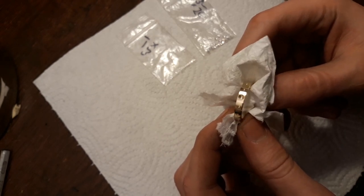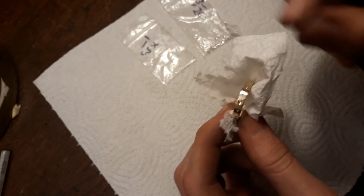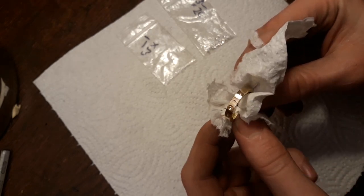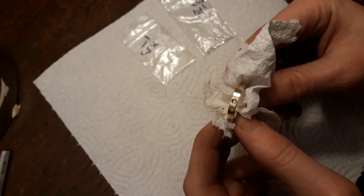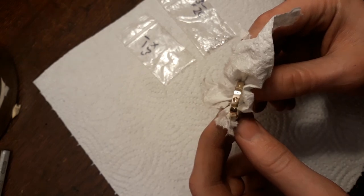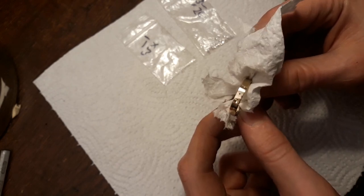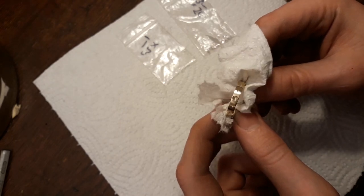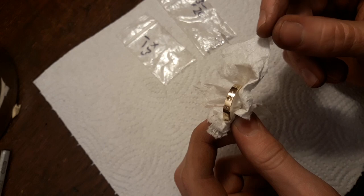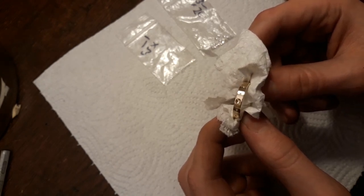The first drill operation is going to be the 3mm center stone. I've clamped it down and used a different kind of drill to get higher precision. Now the holes are drilled — sorry for not getting any footage of that, but it's really hard to do these very fine tasks and film at the same time. As you can probably see, it's not perfectly on center, so the big stone is not perfectly in the middle between the two smaller stones. A professional would probably remelt this ring and start over, but I've got the luxury of not having to sell this ring, so I'm just going to roll with it. You may be wondering why I'm not holding it with my fingers — it's because if you touch brass it changes color pretty fast, so we'll actually have to get some lacquer on there.